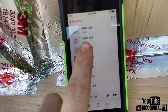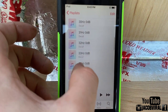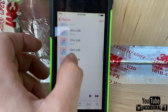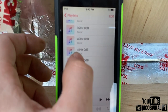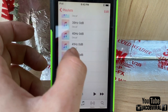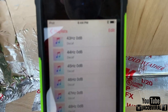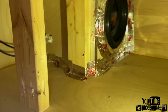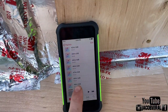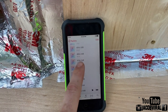In summary: you want to have frequency responses. I started around 23 Hertz and moved my way up. My subsonic was turned up so it cut off the lowest frequencies - at three-quarter volume you'll definitely be able to tell. Right around 36 Hertz it started slowing down on motion, at 39 Hertz slowing down more, at 41-42 Hertz it was perfect and didn't hardly move, then at 50 Hertz it moved again. That's the concept - do this with your box if you want to know exactly what you're tuned to.